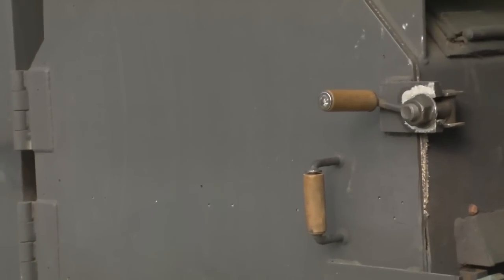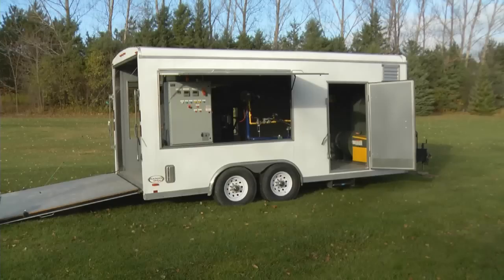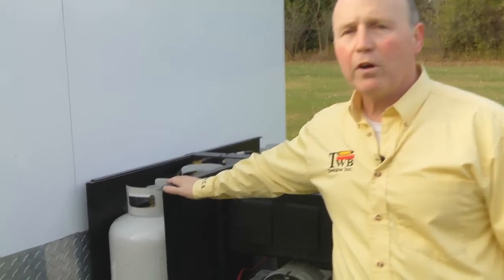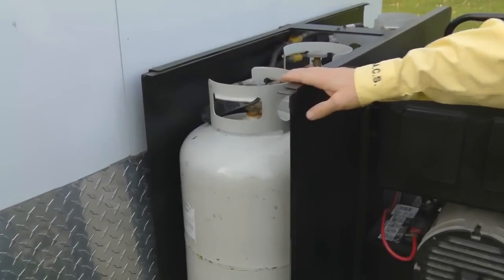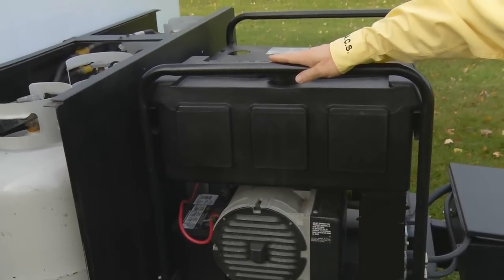The Emax burner comes in an enclosed 20-foot trailer — the exact same dimensions as a 20-foot sea container — so it can be portable or stationary. It comes with four 30-pound propane tanks and an 8,000-watt heavy-duty commercial generator, and it can also be run on butane, natural gas, or JP-8 fuel for military applications.